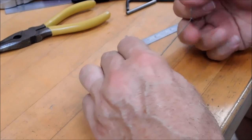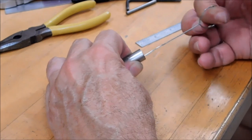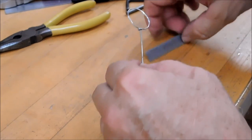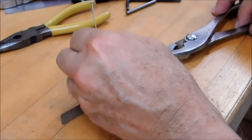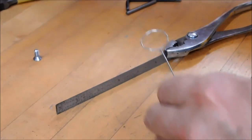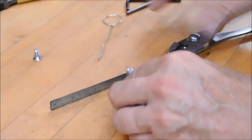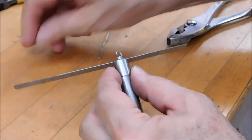All right. Now pull the spring out to a point where you can see the exposed inner coil. Now there's no easy way to do this in frame, guys, so I'm just going to have to wing this for a second. I'm going to hold my scale with a pair of pliers, as you can see, which I think is a pretty good idea. I'm going to pull this out, and I'm going to engage one of these coils on that. There you go. Okay, now you got a loaded bomb. Thread the other screw on here.